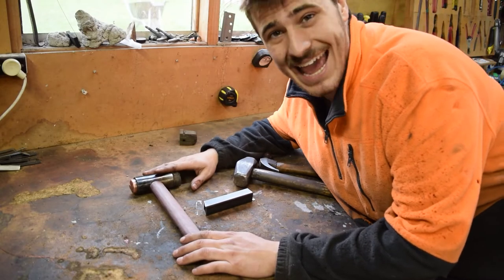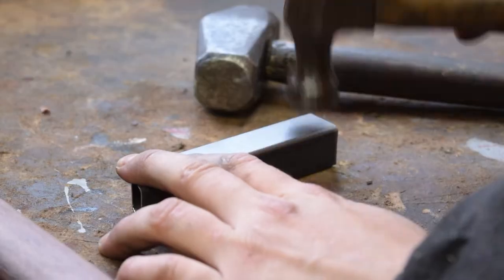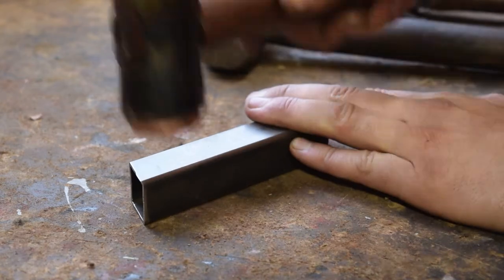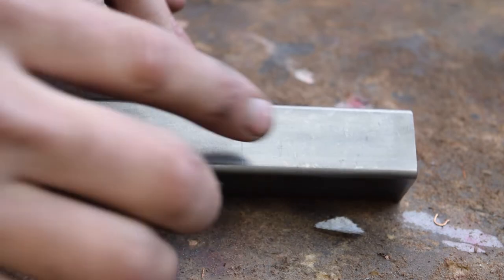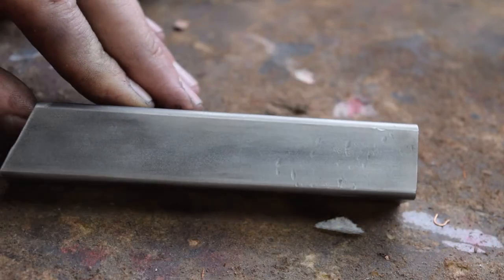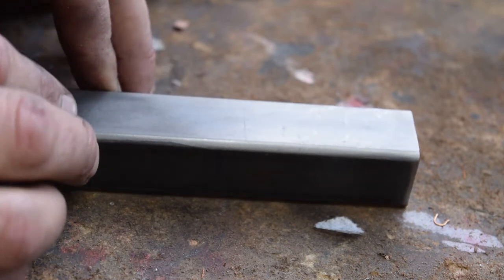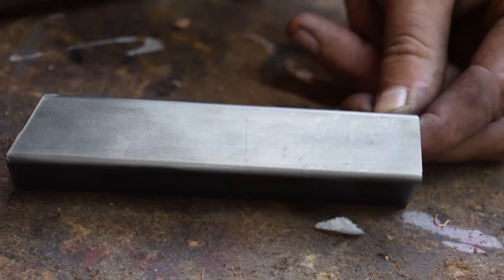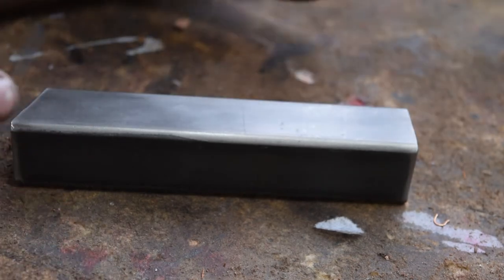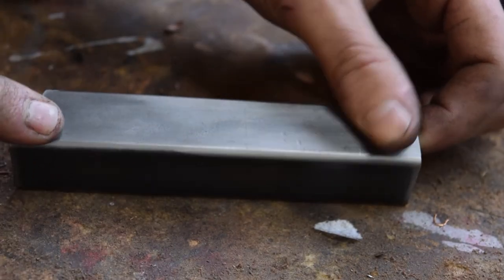We're just giving the hammer a wee test to check if it actually works as a hammer, as well as to see if the copperhead is soft enough to not leave any tool marks or scalloping. Looking at the piece of steel, you can clearly see the difference between the two sides — this was the copperhead and that was the framing and lump hammer. You can actually feel all those blemishes, they're very visible and a little bit deep. Where this copperheaded hammer hasn't left any physical marks — it's not visible nor can you feel anything with your finger or nail. I did actually give the copperheaded hammer some really substantial smacks — it would leave a little mark but it would just wipe off. Genuinely a really hard hit, but if you just wipe it, that blemish just disappears.